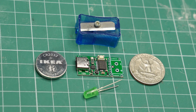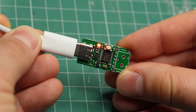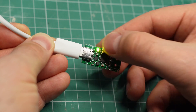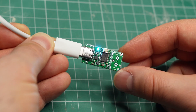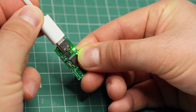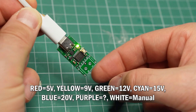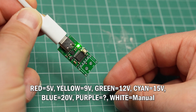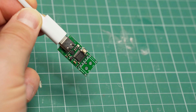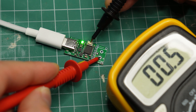It is slightly bigger, but it has more features. Most importantly, the output voltage is adjustable, and there is a status light indicating the voltage setting. By default, you press the button to cycle through available voltages, but you can also set a fixed voltage setting. You do that by holding down the button and plugging in the cable. At this point the lights should go into disco mode. Then you release the button and pick a voltage setting — here's what the different colors mean. This will lock the voltage and disable the button until you do this procedure again. Or you can pick the white setting to select voltage manually. I'll be testing its power handling in a bit.